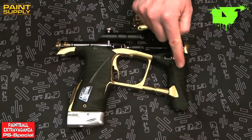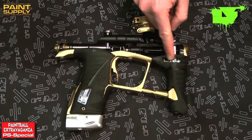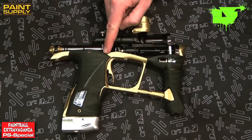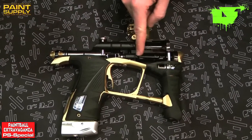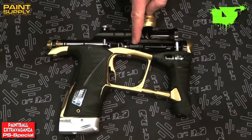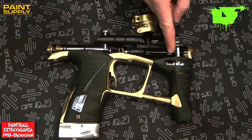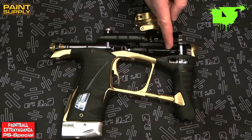The air from the in-line then splits in two directions. Firstly, it supplies the LPR which regulates it down and directs air to the solenoid up through here. Secondly, it feeds the valve chamber which is this large area here. Inside the valve chamber, you have the exhaust valve, which sits inside the valve guide, and then there's a valve spring which we've shielded. When air leaves this chamber, it reduces the turbulence of the air flow.